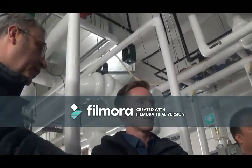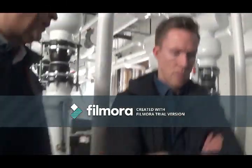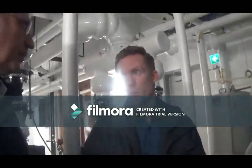The other thing is, if I go into the boiler room and I see water on the floor, what should we do? Is that something we have to pick up right away? It depends on the severity of the leak, right? The biggest thing is we need to determine where it's coming from. There are a lot of sources of water, even in this small area. You would get some condensate in the long run. Exactly. Usually it's condensate, but it could be from the exchanger, it could be from the pump, it could be just off the back or something.